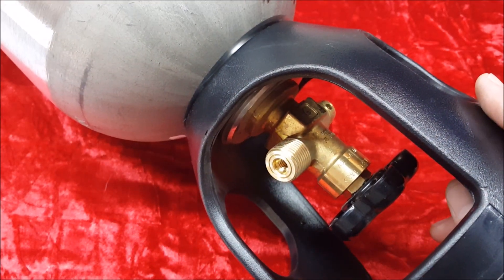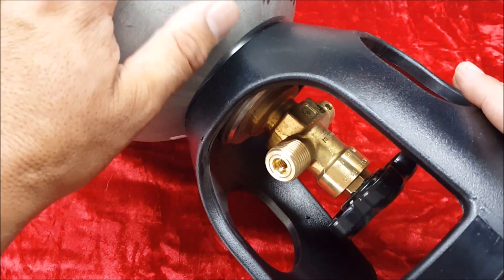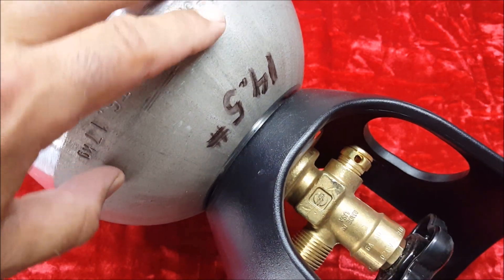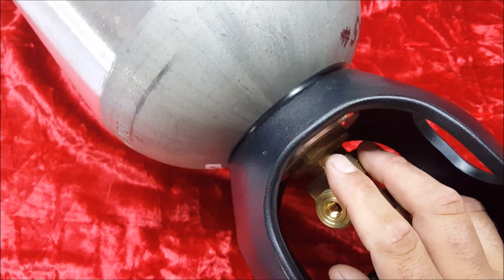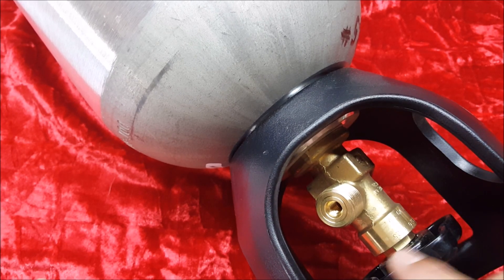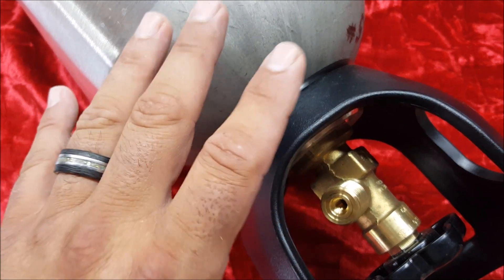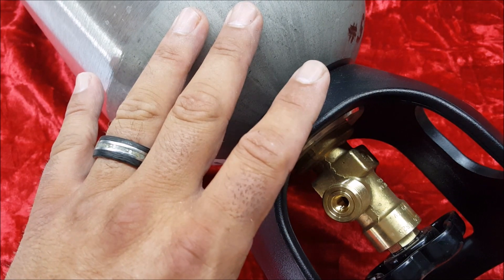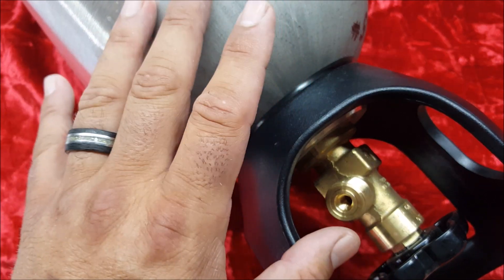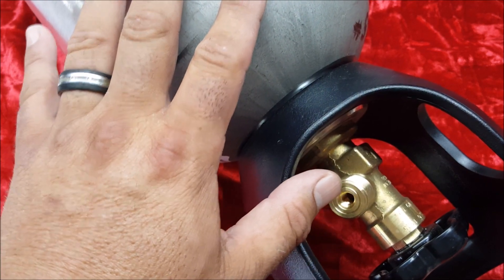At this point, you should weigh the tank empty but with the handle and valve still on — take the regulator off first. When you weigh it, mark the tank with permanent ink. This particular 10-pound aluminum tank with the valve and handle weighs 14.5 pounds. Mark that on the tank — it's the only way to know how full your tank is and to verify you're not being ripped off by the place that fills your CO2 bottle. Remember, CO2 is not compressed air. It's liquid inside the tank that boils off gas to maintain pressure. Under normal temperatures, pressure is usually 800–900 PSI, but it can be as high as 2,000 PSI on a 120-degree day or as low as 500–600 PSI on a freezing cold day — it varies depending on temperature.